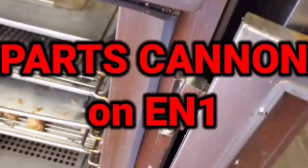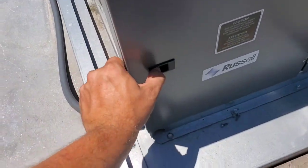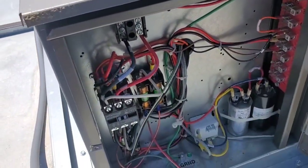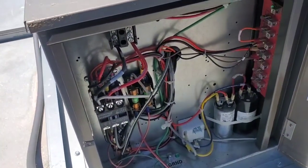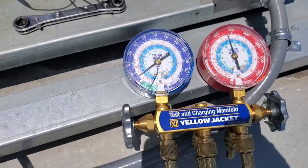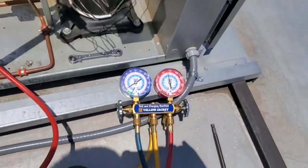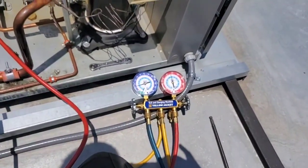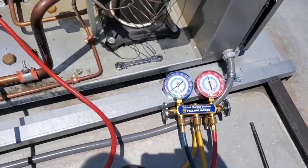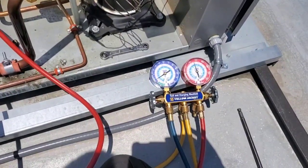Got Russell Techline on the phone. This little walk-in freezer here has a bit of a problem — it's brand new and it short cycles. The scroll compressor has a little check valve inside the discharge side that lets too much gas loose, so it sits here short cycling.